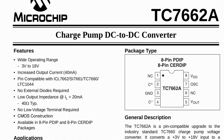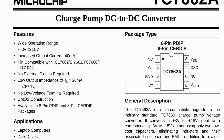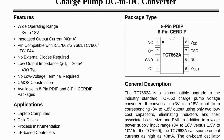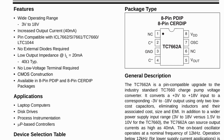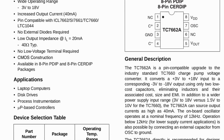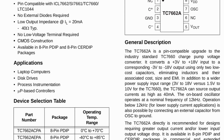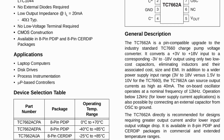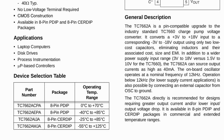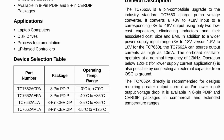However, it comes with a slight caveat. There's 2 versions of it. One of them is in an 8-pin DIP, and the other is in an SOIC, but it's in a 16-pin SOIC for some reason. It's an 8-pin chip in DIP, but 16 in SOIC, and in SOIC, half the pins are just not connected. I mean, why? So the DIP, counterintuitively, is actually a smaller chip. So for this design, I've actually had to resort to a DIP chip of all things.